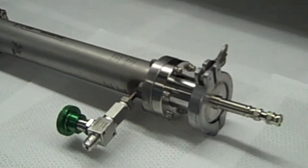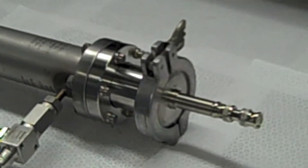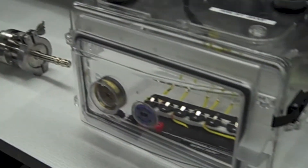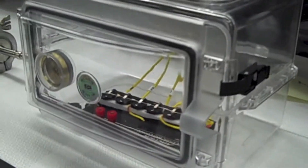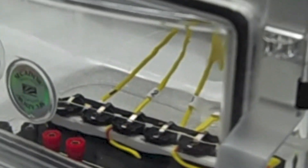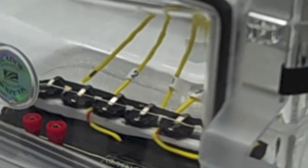I realized quickly, based on the length of time it takes to perform longer cycle measurements, that it's not practical to measure one battery at once. So I designed a larger oxygen chamber which allows testing six lithium-oxygen batteries in parallel. You can see the oxygen inlets up here and then you have your electrical feed-throughs to each of the six battery holders, and you can run as many battery tests as you'd like in parallel at once, up to six.